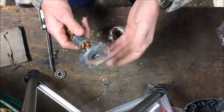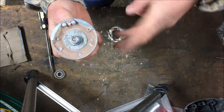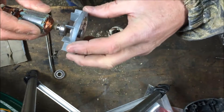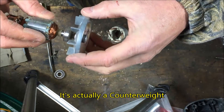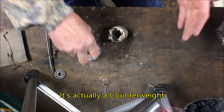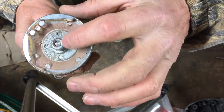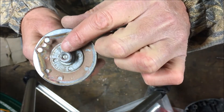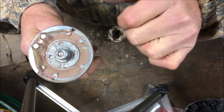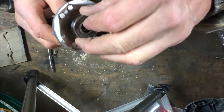Back to the way these things work — if you look at the center of this fan, which serves more purpose than just a fan, its other purpose is to actually make this sander work. It is drilled off center — you can see that, they did it on purpose. This bearing slides over there.